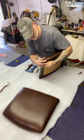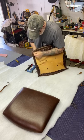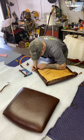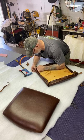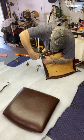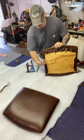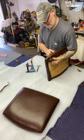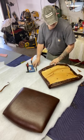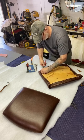So as long as you're square and you're flat and you're not distorted, which we're not, make sure they're even on both sides, which they are now, I can see. You pull it tight. Yeah, I like it. And try to follow the contour. When your staples along the margin come up, you want them to arc the same way. You see how we got that wrinkle there that doesn't fit? Remove this staple, maybe that one. You never know how many you're going to have to get rid of. Gently pull them out.